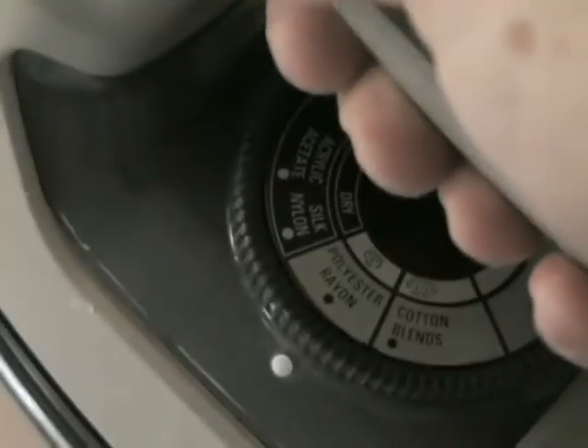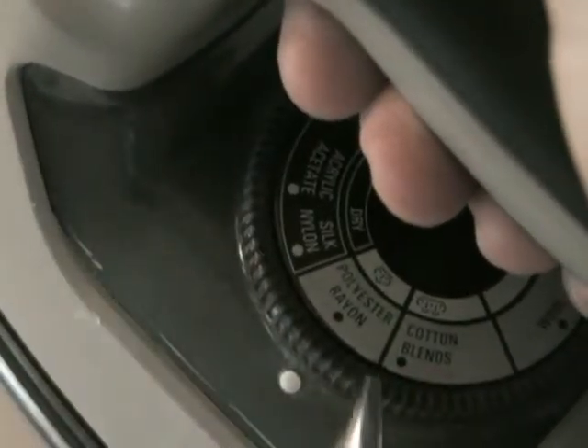The copper has been cleaned up with the steel wool. We have our board layout on our press and peel material. The next step is to transfer the image from here onto the board. Since the material is called press and peel, we're going to use an iron to press it onto the copper. I've got it set at about polyester.